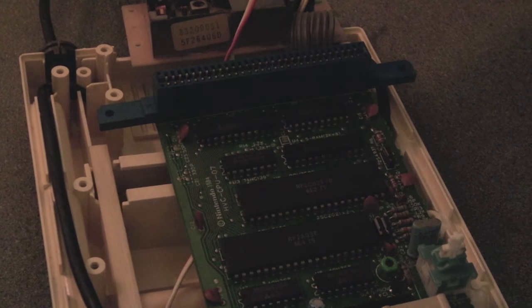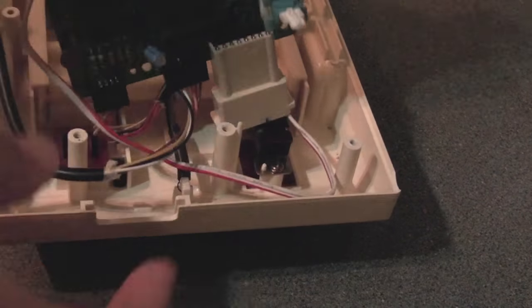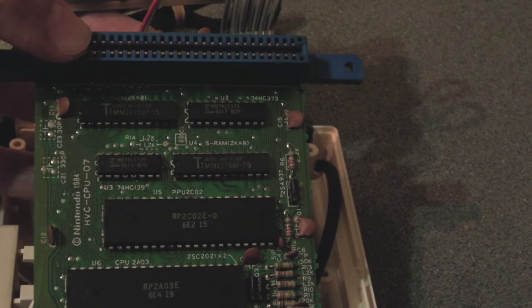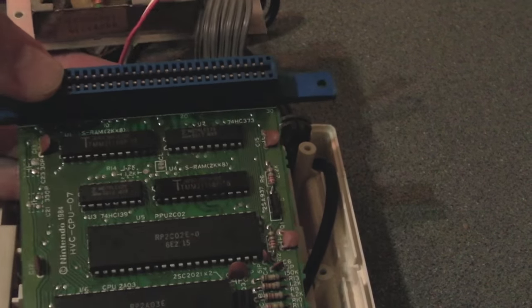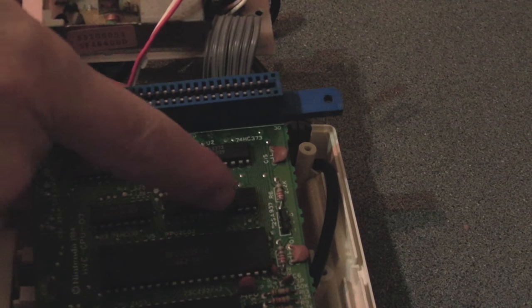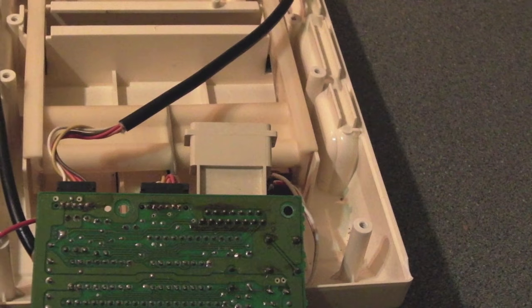A bit of a change of scenery here — in the kitchen, my wife's away, so some kitchen soldering, don't tell her. I'm going to have a go at removing the SRAMs from this. Because it's going to be a few weeks before the spare SRAMs I've ordered arrive, I might take the working ones off the board with the broken switch — the one I showed previously that's working — and put them on here. I do think it's going to be the SRAMs. I'll get them off and show you up close the corrosion on the pins on both chips. No corrosion anywhere else on the board. I'll show you part of the removal — just zooming in and showing removing a bit of the solder off some of the pins.